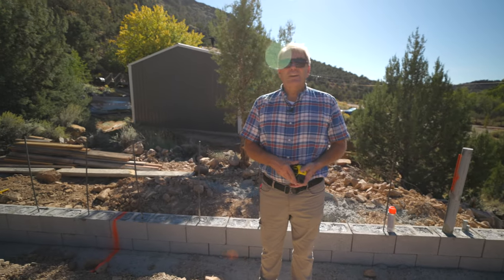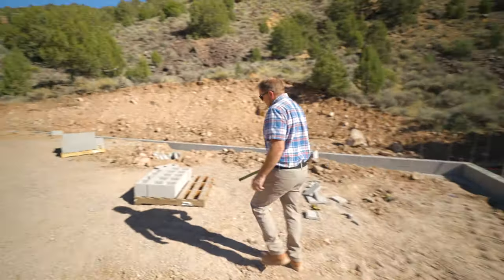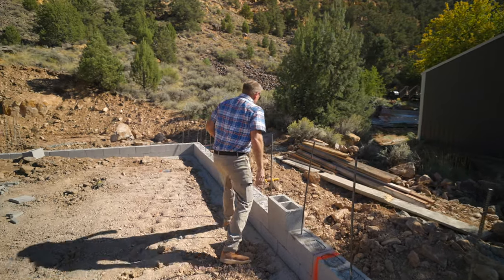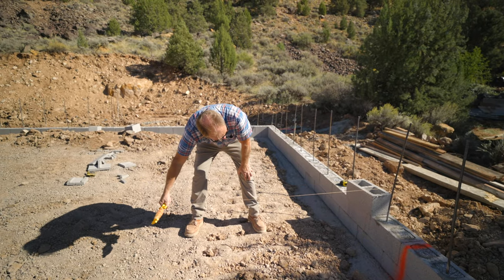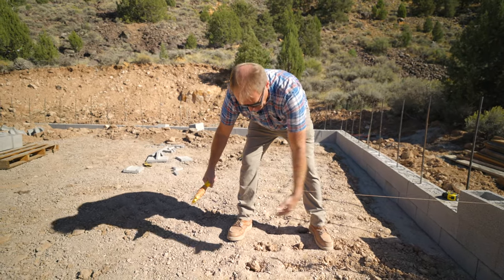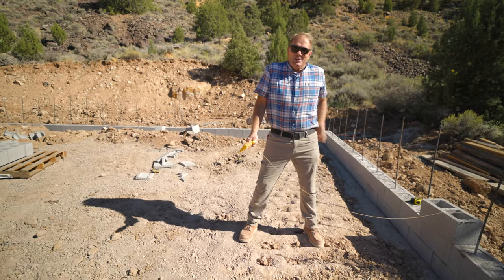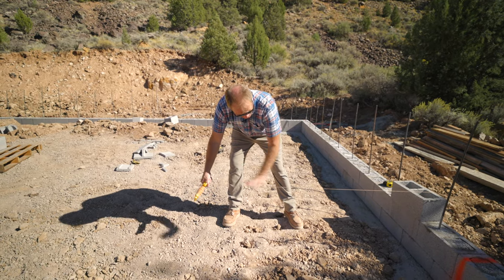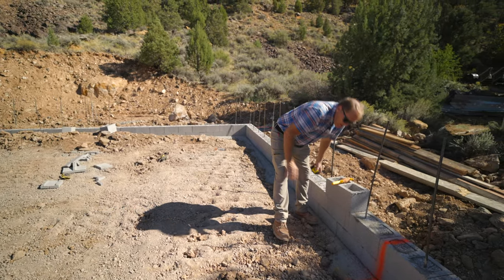The good thing is it's not going to be much digging for him, because the top of the foundation is going to be 8 inches. So if we look at the wall here, this is an 8-inch block. We take that block, put it right there — he'll take a string line all the way across and put another block on top. Pull it tight, that block's not going to go anywhere, and that's the top of the foundation. All he has to do is bring his pipe up to the top of the foundation. I told him there's not going to be much digging, and he couldn't believe it. So look at all the lack of digging he has. I've got a high spot down there but we're going to backfill all here, so it's going to be pretty easy going for him tomorrow.